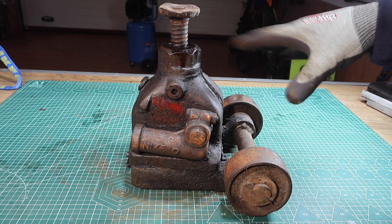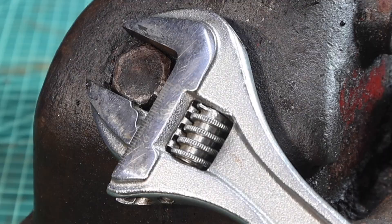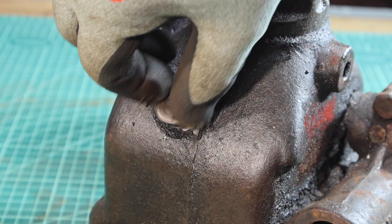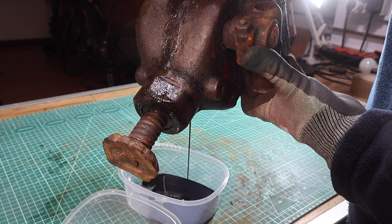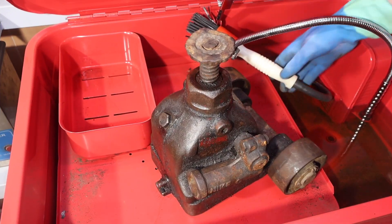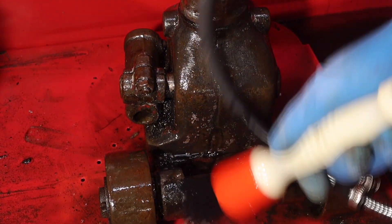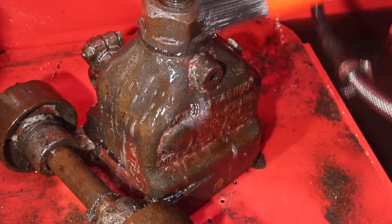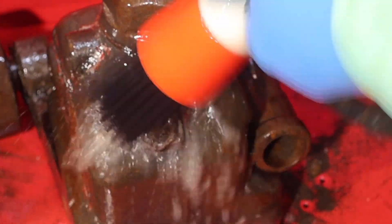It just leaves me now to do some initial cleaning up and try to get it back to bare metal. This is a degreasing tank using a chemical which is basically for removing any type of oil residues — basically cleaning things up.